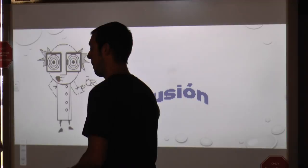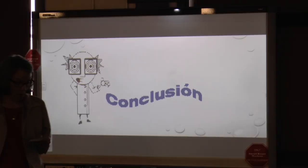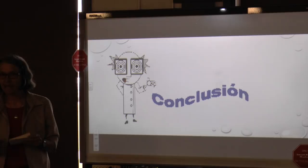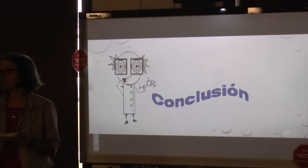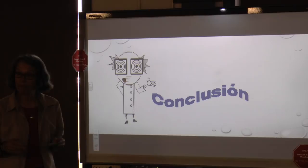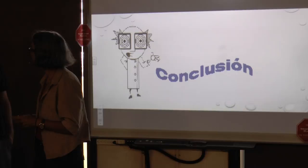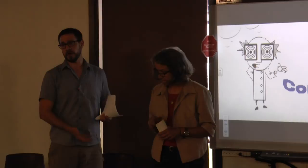What we concluded with this nine-day project on the hot water system was: we need a good tracking system and really some good reflective materials. We also concluded it is not an efficient form of technology to heat residential hot water due to low efficiency and high risk of malfunction from high temperatures. It was a pretty interesting exercise to see our one meter of concentrated solar comparable to our one meter of passive solar on our tanks — satisfying when you run all the numbers and they actually make sense.